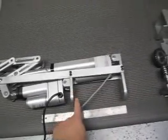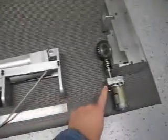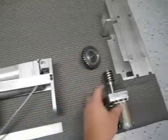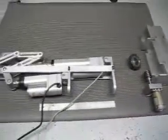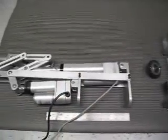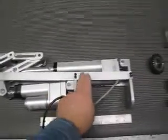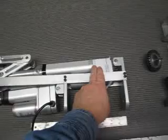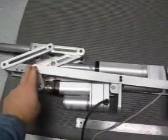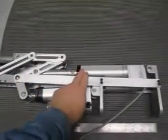There will be a gear associated with this lower section, and over here you can see this is the worm gear that will be going on here, along with the motor assembly for running it. These two motors are linear actuators — the one for the kick assembly has a two-inch throw, whereas the lift assembly has a four-inch throw.